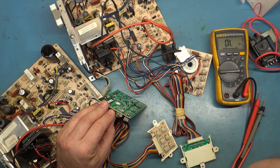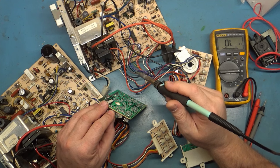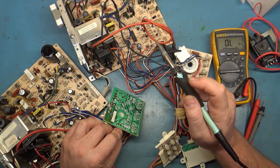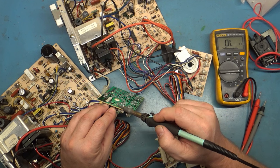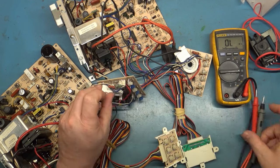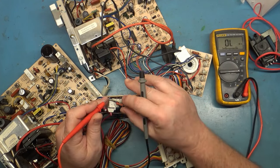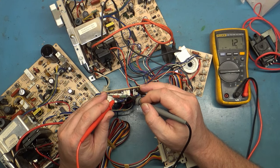I'm going to need to take this off and measure them separately. My iron went cold on me — I need to stop turning the iron on before I need it. Once it's warm enough, we'll get this component off of here. Now we can measure these separately: this one reads 2.3, which is correct. The one that's parallel with it is 1.2.